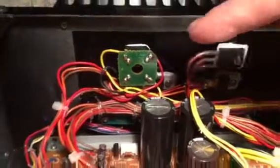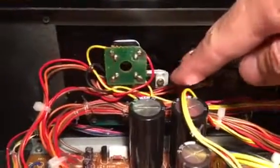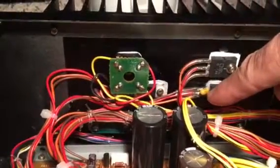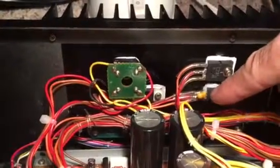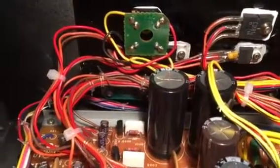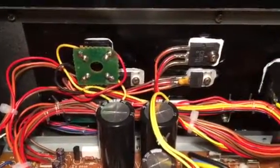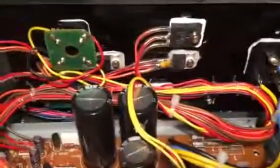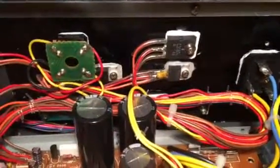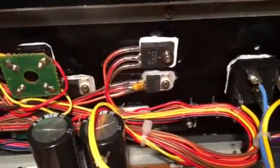This is the bridge for the plus/minus 26 volt raw supply, so the 7815 is tucked behind that. Both of the 15 volt regulators have 2.2 microfarad tantalum capacitors strapped across the input and ground of each, in the correct polarity orientation based on the differing pinouts of those two parts and the differing nature of the two regulators — one being a minus 15 regulator and the other a plus 15. Those are isolated from the heat sink with mica insulator pads.